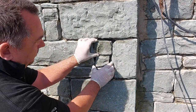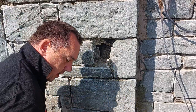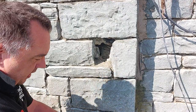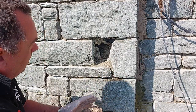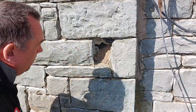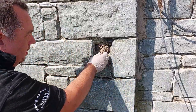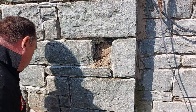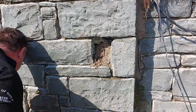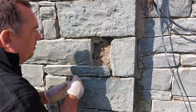So that'll go back something like that. Don't be scared to use your hands, but make sure you've got gloves on. Use any bits of mortar that you've dropped on your sheets to do this. Fill it back, push it back. Get any little bits of slate and just push them in to keep it bonded — any bits of stone. It stops it cracking again.